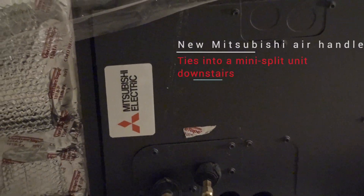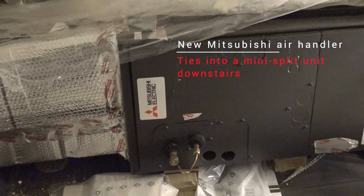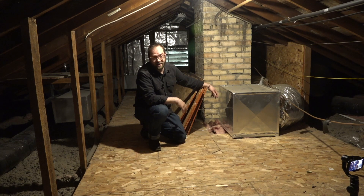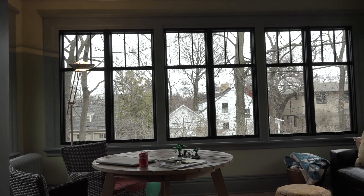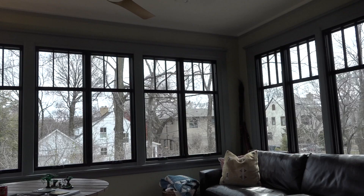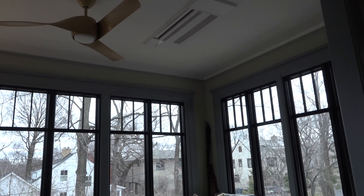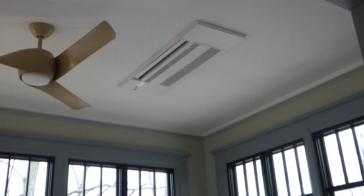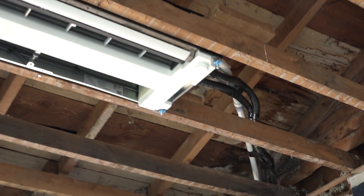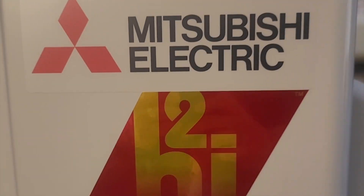We'll get a new air handler up here, tied to a condenser that's also running a couple of our mini splits below. Ultimately, this fairly awkward, hot, uncomfortable space is going to become super comfortable, and the house's overall efficiency is going to jump pretty dramatically. Another tricky space is the sunroom. It should stay warm in the winter with a classic radiator fed by a high efficiency boiler and triple pane windows. But even with a low solar heat gain coefficient, this room will likely need cooling, so we're going to put one of Mitsubishi's easy fit ceiling cassettes into the ceiling, running the condensate and refrigerant lines down the wall, across the floor system, and out to the condenser unit.